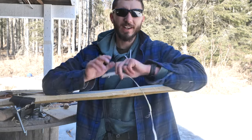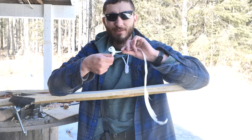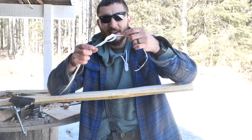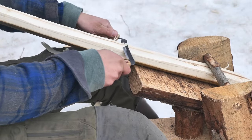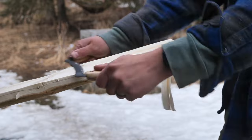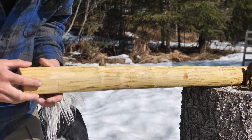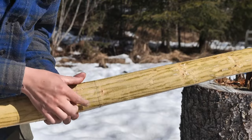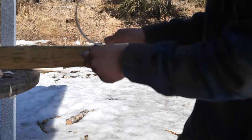I think about the limits of bending wood and when you do this you realize that if the wood was infinitely thin you could bend it infinitely tight. So if I want to make myself a nice recurve bow, I just need really wide flat limbs. I drew a couple lines — I tapered it to the width of my pointer finger from about a forearm length down. The handle section narrows and gets wider and then I'll carve it into bow shape. I'll thin this down one more time and then we'll start the speed drying process.